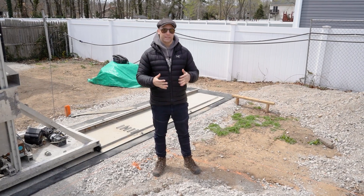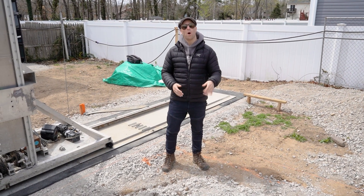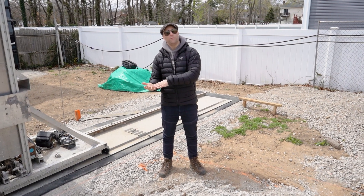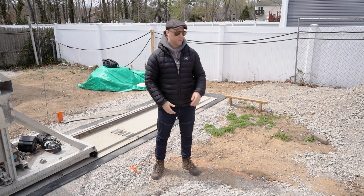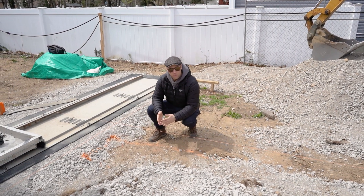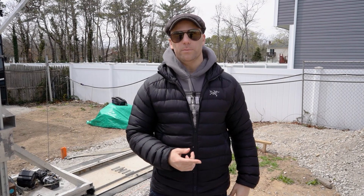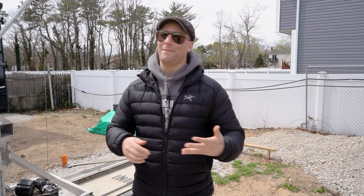When I first looked at this layout, I pulled the plans out and said the bedrooms look very, very small. But SQ4D explained that's not exactly how it works — this is the outline where the bedrooms are, but the bedrooms are actually much larger once you account for the excavated footings under the interior and exterior walls. The house is going to come out right to this piece of twine here. The master is 13 by 14 and the rest of the bedrooms are 11 by 12s — more than adequate by New York first-time home buyer standards. In addition, the house is going to have a gray water system to collect rainwater for lawn irrigation, a Tesla charging station, solar panels, and radiant heat. This is truly a house of the future — eco-friendly, far less expensive, far faster.